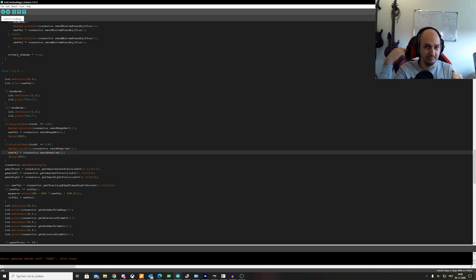In the future, I'm able to change it so that you have a variable baud rate. Let's say you want to have a device that can only send at 9600. You can just click a checkbox, I want it at a lower baud rate. So that's something I can work out if you guys need it in the future. So right now you can use it with any device that has a serial communication line at a baud rate of 115200.